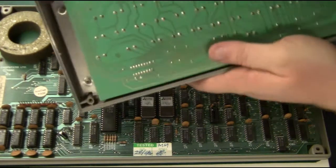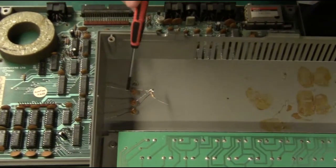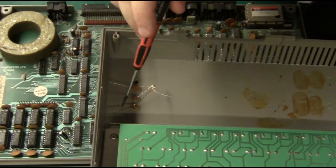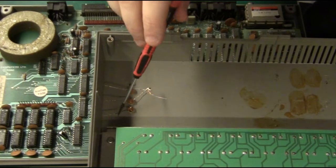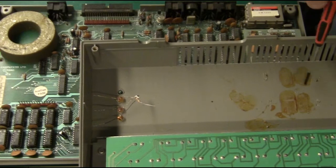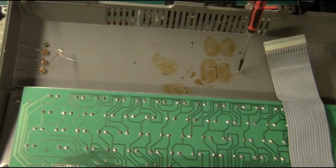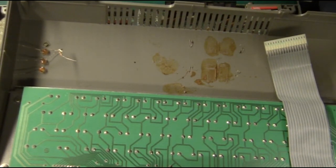This machine has the LEDs — you can see there are 3 yellow LEDs just drilled and soldered into the box. They are all glued together and soldered with a 100 ohm resistor, probably going to some I/O port so he could switch the LEDs. There is also quite a lot of leftover glue in the cabinet itself, and something has been melted by a soldering iron here, so I think he was controlling something.